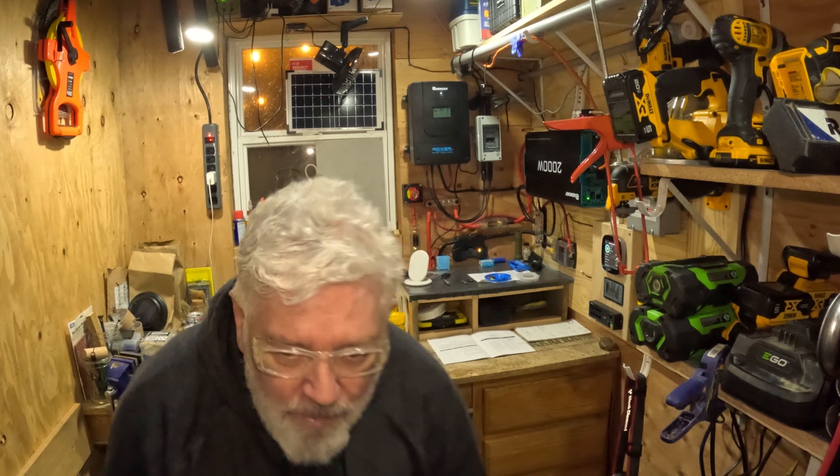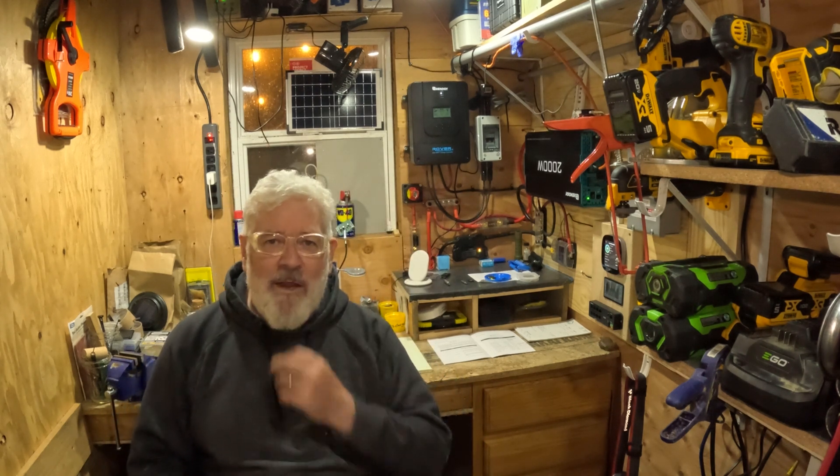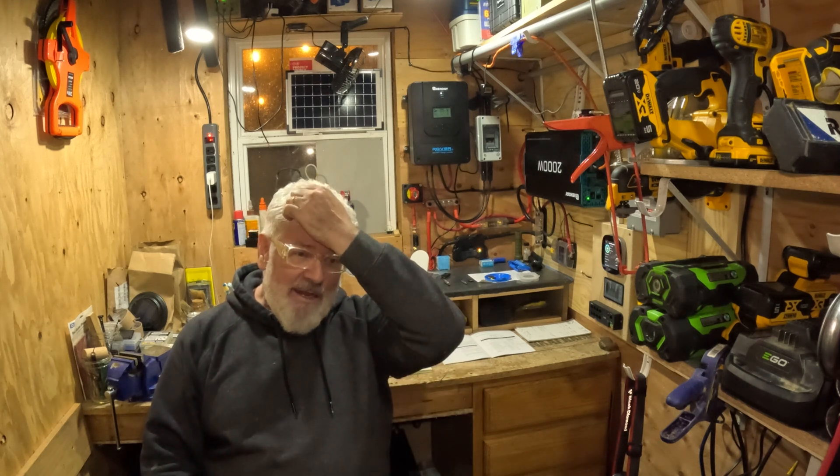The 14.4 I can understand why it was triggering — it was kind of a battle between disconnect mode and full charge mode. What baffles me is that for six months this controller has been running like this and the battery has been fully charged almost daily. Then it just disappeared out of nowhere. Renogy doesn't actually have an answer for me on why it just started doing this out of nowhere.